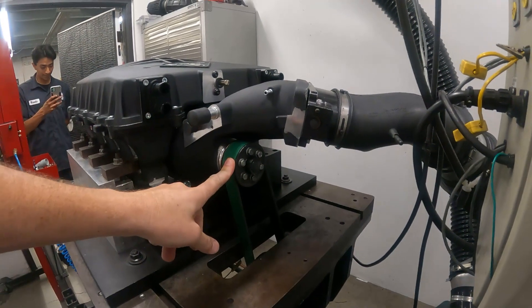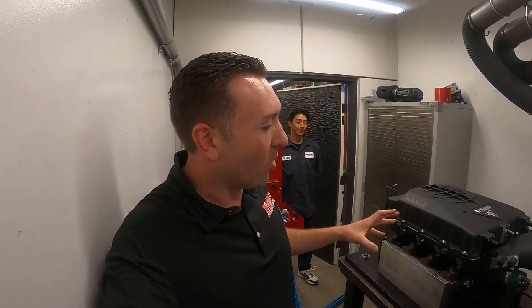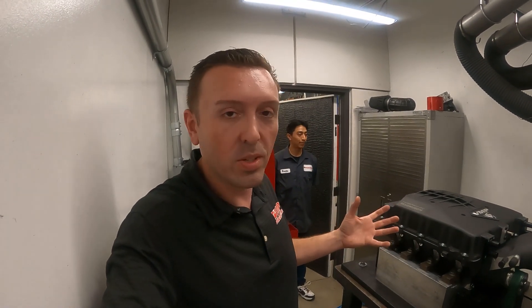Up here, this is actually a 2.6 inch pulley used for testing. Most of you putting an Odin on your vehicle are not even running a 2.6 inch pulley. So one of the goals of this testing is to run the supercharger hard — burn it in. It gets run for three minutes at different RPM and boost levels, just to test it out and make sure it meets all the performance specifications it's required to meet.